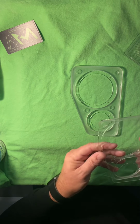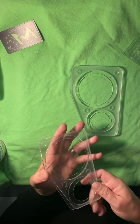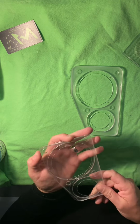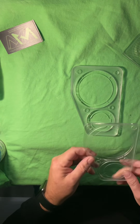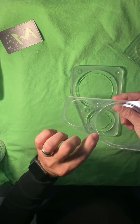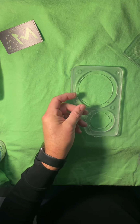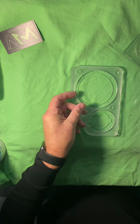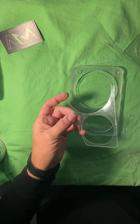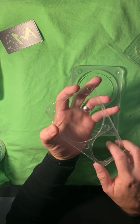Then in this particular scenario, we want to cover up the mounting screws. So when you look through the grill or you even pull the grill off, we don't want to see the mounting screws, right? We just want to kind of see the speaker itself. So this will be a totally separate layer. And this starts out with a thin piece that's cut the exact same size as the grill, the outside dimension of the grill, but the holes are exactly like this one, no magnets. Then there's the magnet layer, boom, like that.